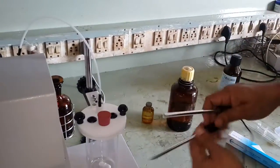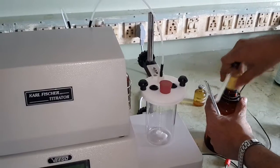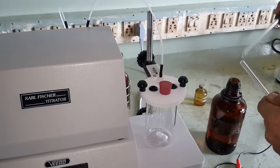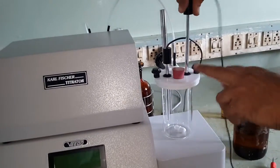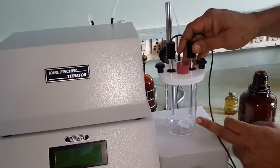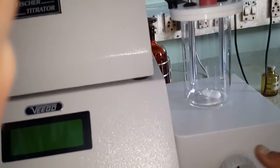These are the two platinum electrodes. Insert one electrode here — if it goes too tight, apply a drop of methanol. I applied one drop of methanol so it slides in smoothly. Insert the second electrode as well. Adjust the electrode height so it is about an inch above the rotor, so that when the rotor rotates it does not hit the platinum wires.